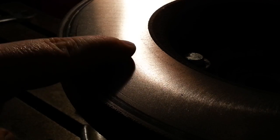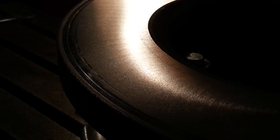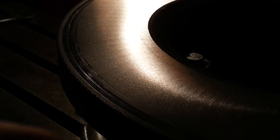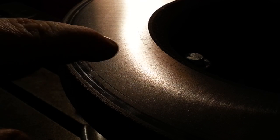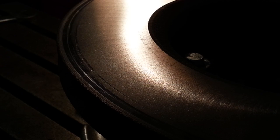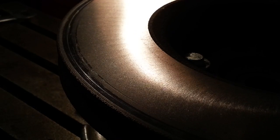I've done my best with exposure and lighting to try to give you an idea of how good a finish that gave me just on the first pass. I'm totally satisfied with that finish, and for the finish pass I'll just run another pass until this cleans up — probably just two thousandths or so — and this side will be done.